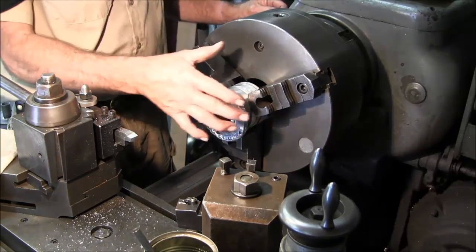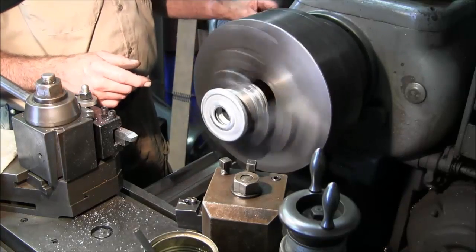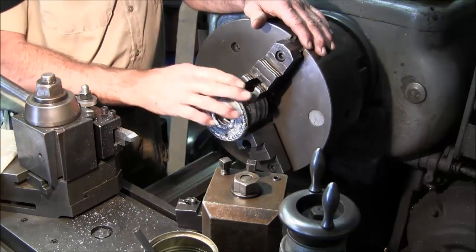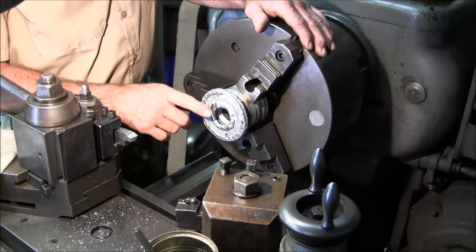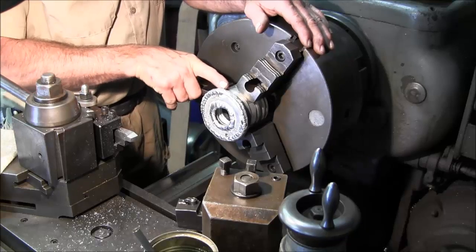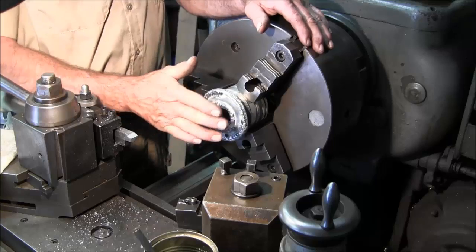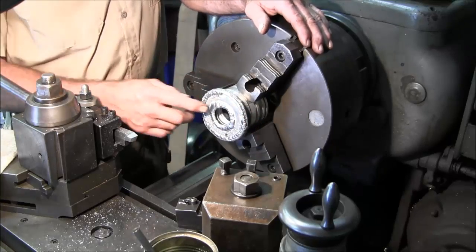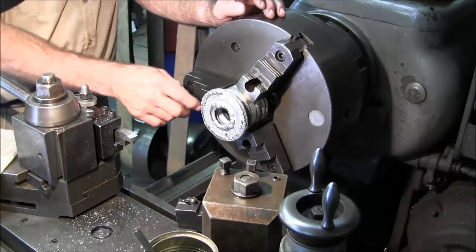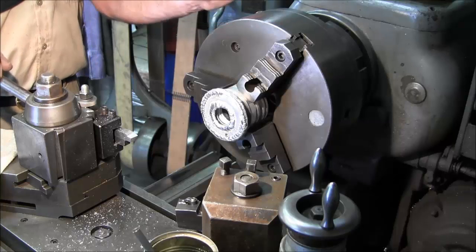Three jaw here, and we've put it in a couple different positions and tightened it down. We're happy with the run. We're going to start shaping the build up here so that we have that inner lip for the wiper and face of our cylinder, OD, and a little chamfer, just reclaiming some of the OD of this thing from being hammered by rocks and all of that. Alright, and we're going to turn and get this diameter here first.